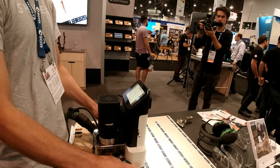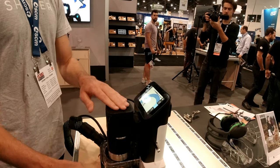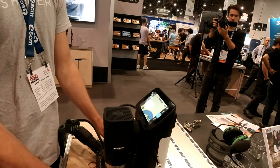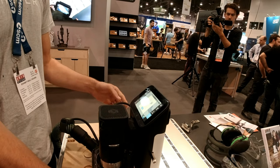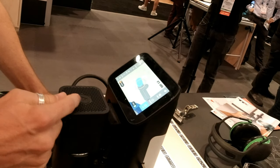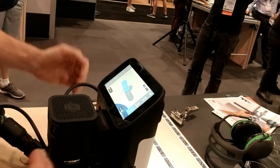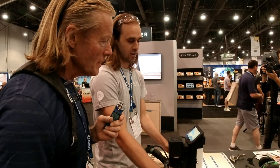If the camera can't see tape, the unit will not respond, so it's very important to set it up so you can always see tape. While you're cutting, the spindle is actually correcting your mistakes. If I build a quick file and move the unit up or down, the spindle will correct to stick to that line. You've got about a half inch of play — if you're a half inch off, it'll still get you on the line.